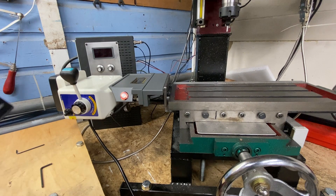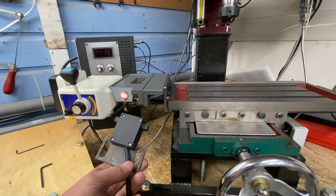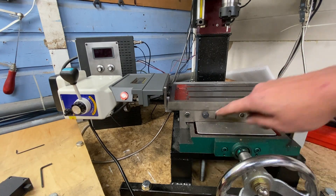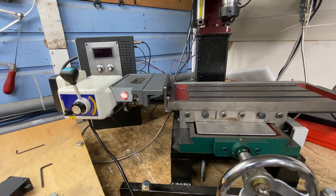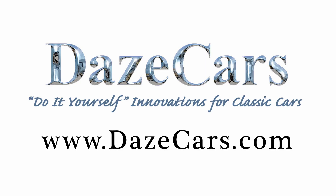I still need to mount the safety stop switch. I've got to figure out how to get it mounted so that as we approach the max travel, it shuts the unit off. The problem is it needs to go on the front and I've got all these screws that are setting my gib. So I'm going to have to come up with something. Overall, I'm very happy with how this came together and I think it's going to save my arm from getting tired and ultimately create better cuts when I'm surfacing something. If you like what you've seen, please click like. If you'd like to see more, please subscribe. Thanks for watching.